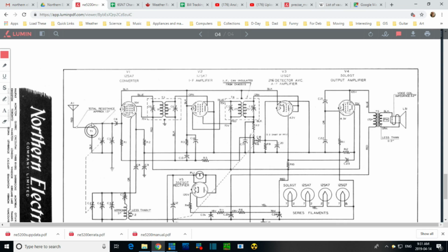So if we just follow this carefully, we go around, and then we encounter this. So between here and here are some number of turns in this transformer. It's a little like an auto transformer here, where they have the antenna coming down, feeding through a number of turns, and then a tap drawing off the remaining turns, drawing power, or voltage really, off the remaining turns. No power in an antenna. That's the whole problem. Somehow you got to get the signal to show up down here with a lot of power behind it. That's the whole deal here.